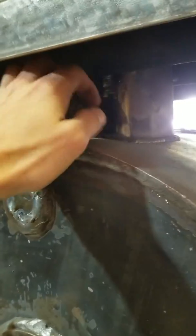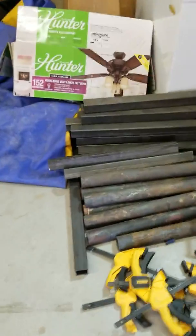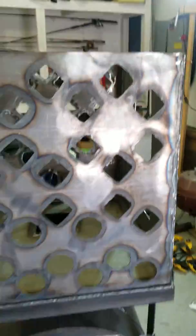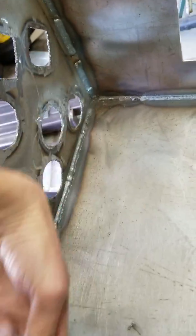That's just quarter inch by six by six tubing, and then it goes up to the future heat exchanger. Right now you can see it's just looking down into the stove, but all these holes are going to have pipes running through them. Those are all the pipes — some I bought, the round ones I just had sitting around. There are 28 of them. This is 24 inches long or tall, and there are going to be baffles every six inches. The air is going to have to flow up and out, come around multiple times, and then up and out the flue and out the chimney. The whole time it's heating up those pipes. There's going to be a six inch gap between each baffle.